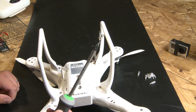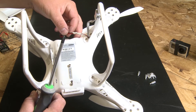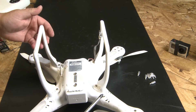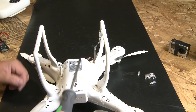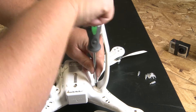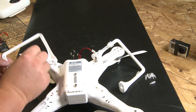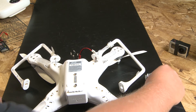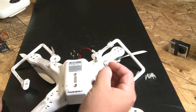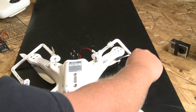I've got a number two Phillips head screwdriver. I'm going to go ahead and take off the landing gear. If you do decide to use the auxiliary power wire that's on the inside of your DJI Phantom, I would recommend that you go ahead and take the whole thing apart and get that out of the way first. I'm going to go ahead and take off these eight Phillips head screws. Then I'm going to take a standoff and thread the male end of the standoff right into the existing screw hole locations that our Phillips head screws fastened our landing gear to.